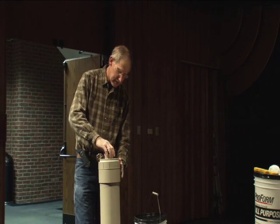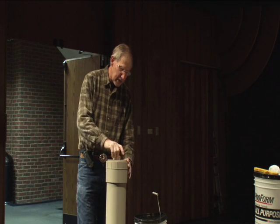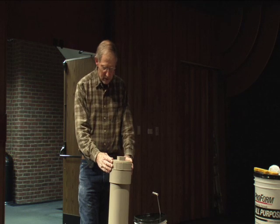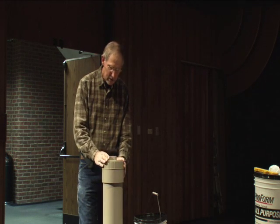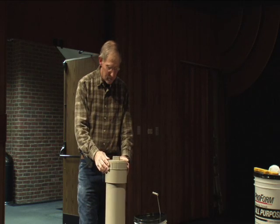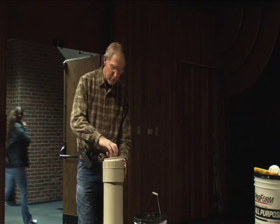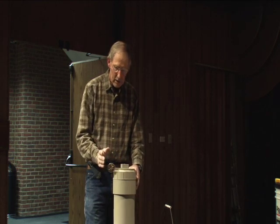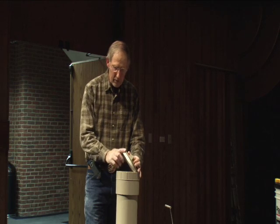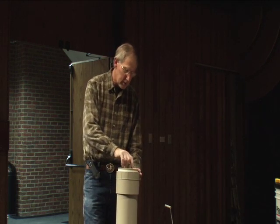And then when you screw it together, it makes a nice seal that water can't get into, at least not for a long time. People do have to replace toilet wax rings on their toilets every umpteen years, but they're good for a few years at least. So that's something that somebody who's serious about wanting to make sure they didn't have all of their stuff stolen could do. Could you do the silicone? You could do silicone as well, but you wouldn't want to fill the threads up with silicone. No, I just do around the top once you get it all. You could clean it off and then do silicone around the top.